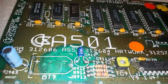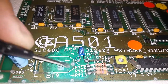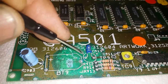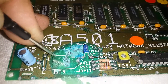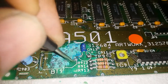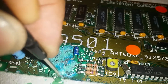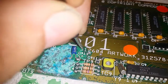I'm going to scrape off the loose stuff and neutralize it with a bit of vinegar. Let the vinegar sit on it for a bit. It's just lifted that straight off — if there had been any small traces there, they would have been destroyed. Blue corrosion — it's disgusting. Unfortunately I'm going to lose the markings for these resistors, but I'd rather just have this off. Get all that scraped off and neutralized.